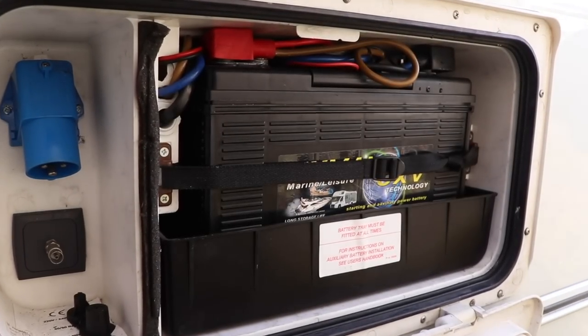Let's go through the pros and cons of taking your battery out of your caravan. Leisure batteries inside caravans are not a once-installed-forget-about item — they do need to be looked after. If you take the battery out, you could take it home, put it on a trickle charge, measure the voltage, wrap it up, put it on blocks, and generally look after its condition. If batteries get very cold and freeze, their condition really does deteriorate — it can knacker the battery over winter.